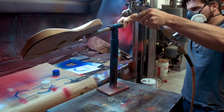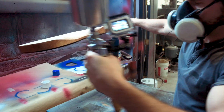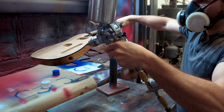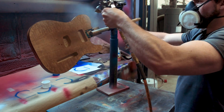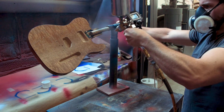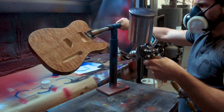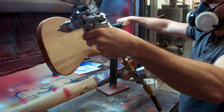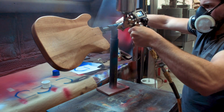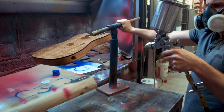I'm going to go ahead and apply three coats of this vinyl sealer from Mohawk. This is, as it stands, my favorite sealer. Depending on the circumstances, sometimes I'll use a catalyzed primer or a catalyzed poly as a sealer — that's a very fast way of doing it, builds up thick, and is a lot more plasticky. But this vinyl sealer dries very quickly, builds up thick enough generally speaking, and I just really like it. It's very easy to work with. You definitely need a mask when you're applying it, but it comes in spray cans as well and they are really easy to work with — very high quality cans.